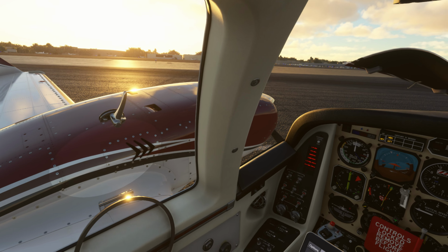So first thing we want to do is remove our engine covers, pedal covers, and wheel chocks, because our parking brake is on. Let's take away the flight control lock. There's the parking brake. Let's go ahead and remove the throttle guard here. Gotta have control for that. And as you can see and probably hear right now, we are running on external power, so the GPU is connected just on the outside of engine one. So let's get this party started, shall we?